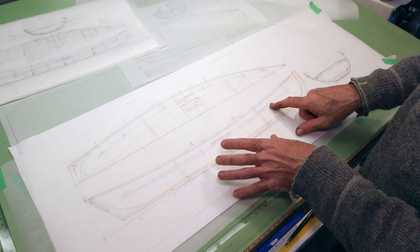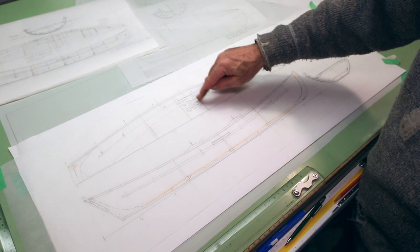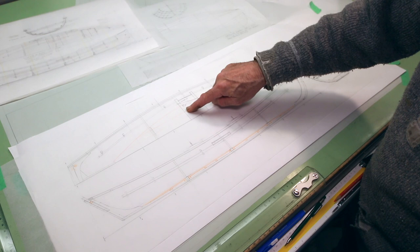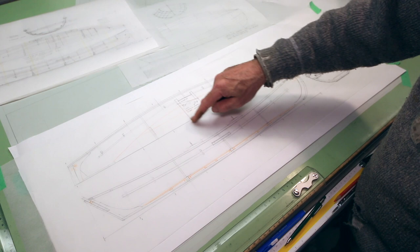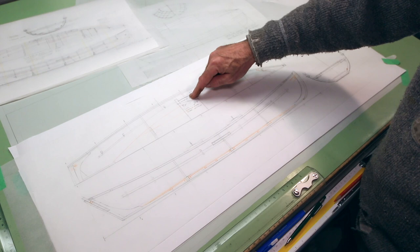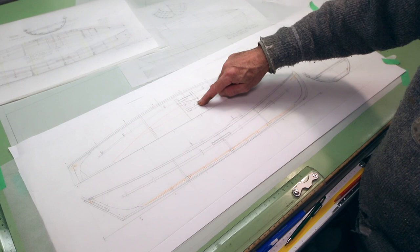So what we came up with is basically a seat frame, much like you would have in a canoe, and a panel that sits on top of that is the seat. And so when Joe wants the forward seat, he lifts the panel off of that frame, and it will fit into the forward position, leaving the framework in behind. Now to the outboard sides of whatever width we need for that front seat, we're just going to have a couple little shelves built into the seat frame. So the shelves will sit down below the frame, the panel will sit on top of the frame, and the frame is basically like hardwood 1x2s or something like that.